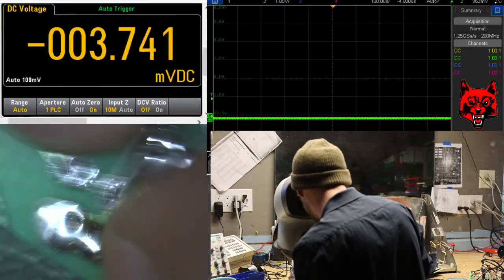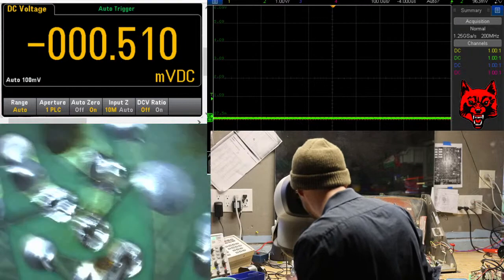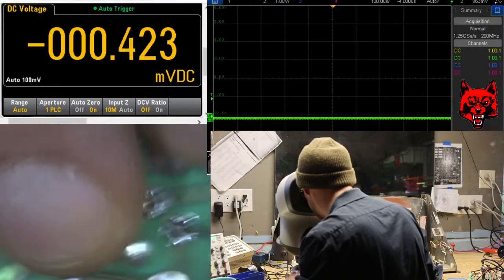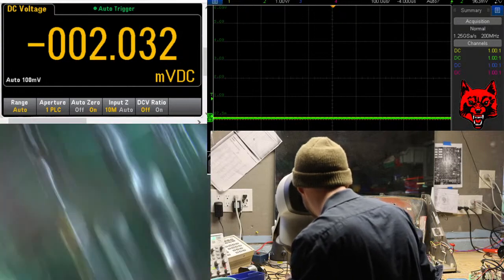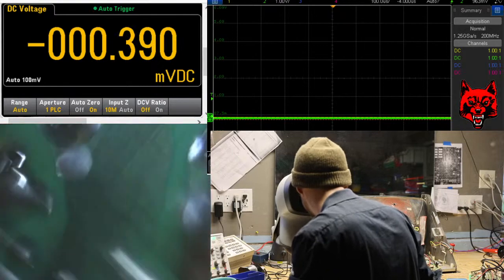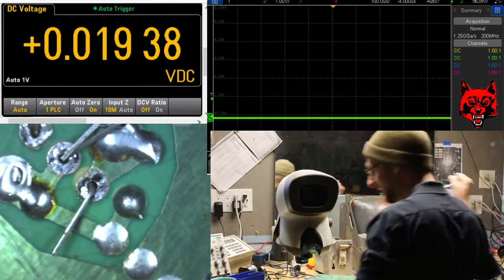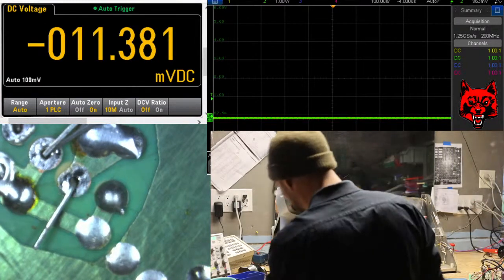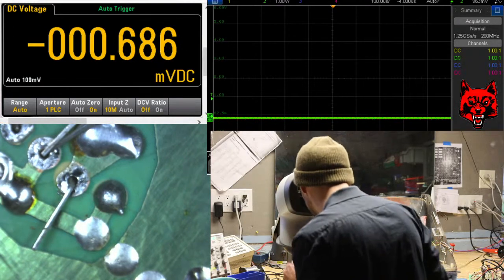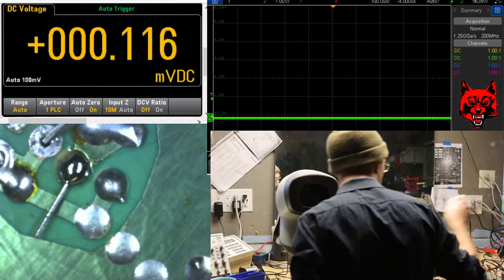Now, these leads, you're supposed to cut them before you solder. I'll tell you why. Because if you solder them first and then cut, you're putting leverage. It's a nitpick. You can still do it. I still do sometimes. But you put leverage on there and then you can kind of pull on the trace. It's just all, you know, the physics of it, mechanics. What I'm saying is if you do this and then cut, it's not ideal.